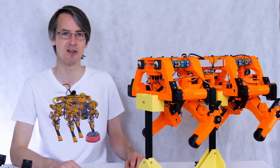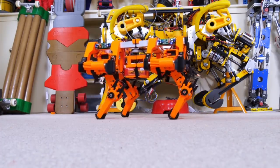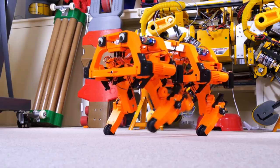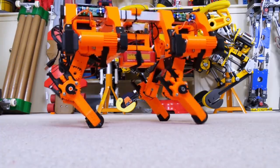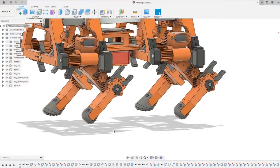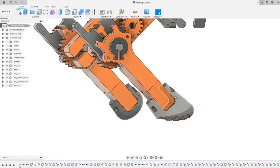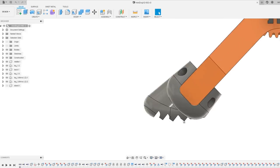Let's have a look at the redesign and the first thing is going to be a new foot profile. You may have noticed in the footage it looks like the feet are slipping as they're going back, and that's for multiple reasons. One of those is that the servos can't achieve the full speed I want, so they don't actually get to the position and they start to pick up before they finish their stroke moving backwards. There's not much I can do about that apart from upgrading the servos. Also the foot kinematics are wrong because the original feet are kind of round and the actual contact point on the ground is somewhere out in front of them, which I put in the kinematic model. So I'm now going to redesign that foot so that as the foot angles backwards, the shin angles backwards too, and the foot actually gets longer rather than curving off and disconnecting from the ground.